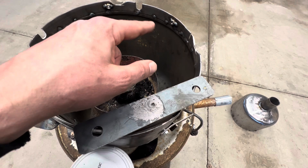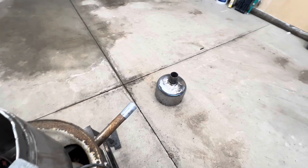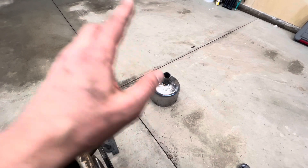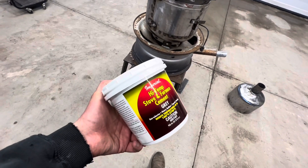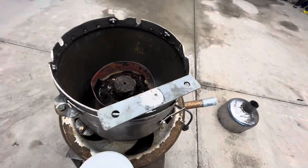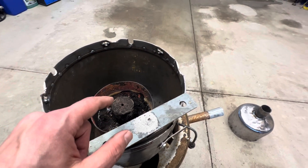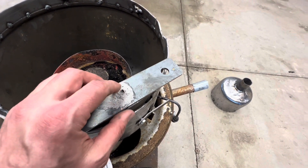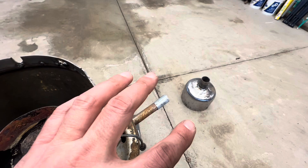I'm going to have to grind down and prep most of the interior surface as best I can — it's going to be a little tough with that flue in there now. In hindsight I maybe should have waited before welding that in, but we'll deal with it. The fabrication is done; we need to get a layer of cement in, let it set up for 24 hours, and then gradually increase the temperature. I'll likely use a propane burner for the first heating rather than the waste oil burner, without the heat exchanger in place, so we can get all the refractory cement cured and ready to go.